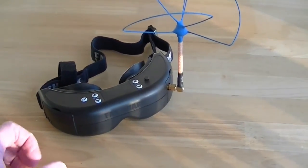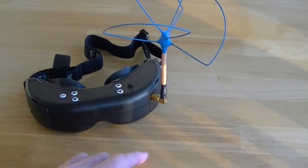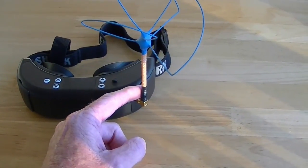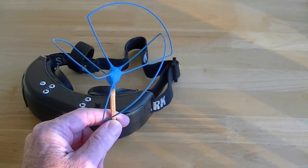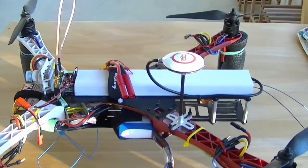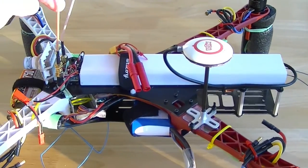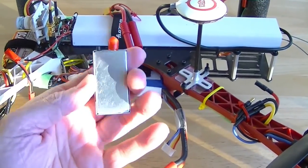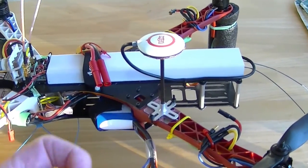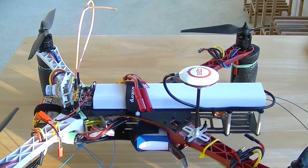My reason for doing all this testing is because I want to use my Fat Shark goggles with the laser brushless gimbal that has a Fat Shark compatible 1280 megahertz receiver. I'll just tell you ahead of time - my conclusion was I needed both the bandpass and the low-pass filters and the lower milliwatt transmitter for it to really work well. I range tested and got really good range with that setup.